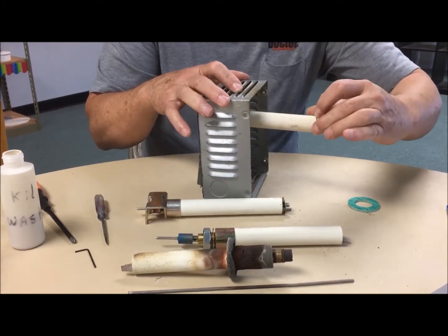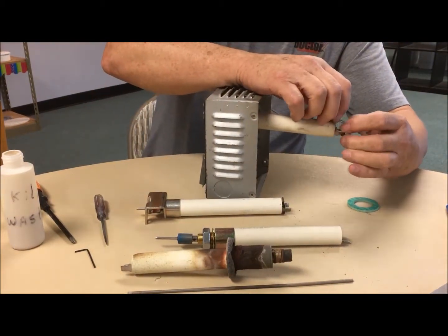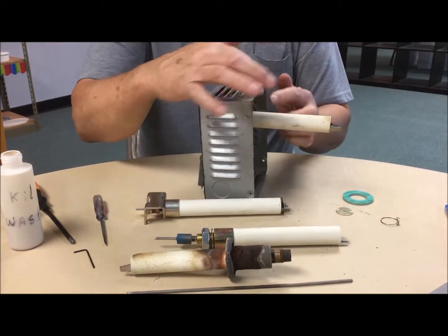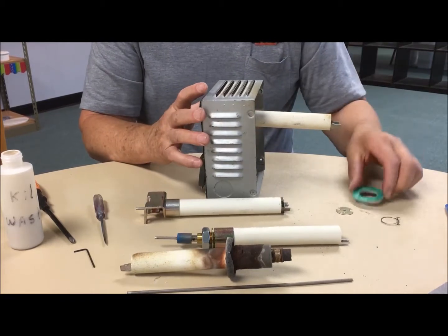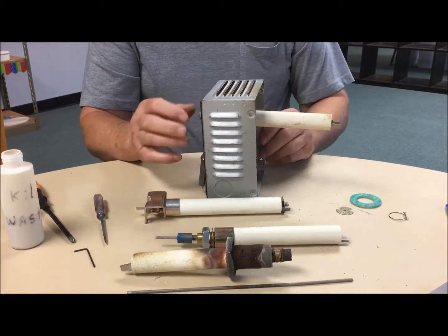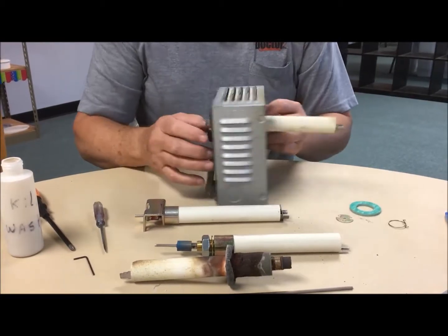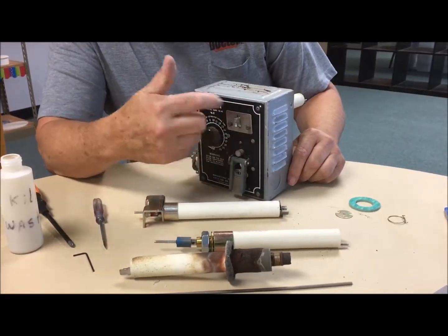Sometimes this has been replaced over the time of your ownership of the kiln, and you may not have thought you needed to put the gasket on. If you have a lot of corrosion where this goes into the kiln, then you should put a new gasket and a retainer clip to keep it in its place. We have the cone supports and the sensing rod. It mounts to the box or to the face plate.